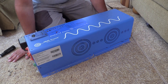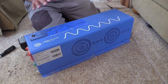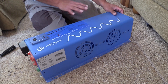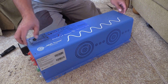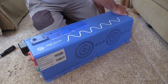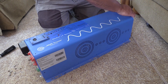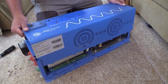So that was the biggest downfall with this inverter — I couldn't limit the shore power intake. There's also no hybrid system on here, where it can add battery power to supplement shore power. I'm not really a fan of hybrid systems anyway — those inverters that can take 30 amps and then supplement power for a 50-amp rig, giving you more than the shore power alone. They're great, but they're not for me.